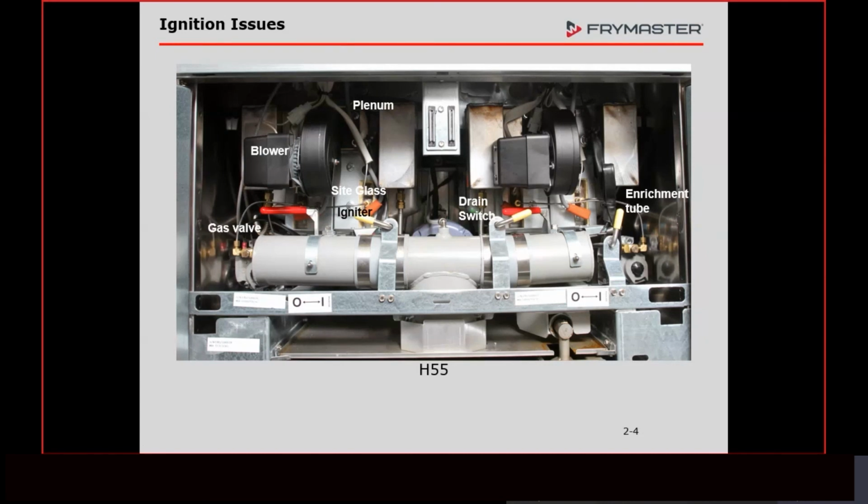As a technician, if you're getting paid to go out there as a professional technician, we don't want to use this to set our blower motor. We want to take out our meter, put it on microamps, and check the microamps to set it. It's a much more accurate way of doing it. On a manager level, that's fine. You have nothing to lose. But as a technician, we need to see where we started with our microamps and then set it accordingly into the range that we need. And if we do that and we see that number go up, most likely we fixed our problem. Just looking at the color, that's not good.